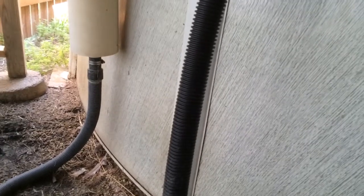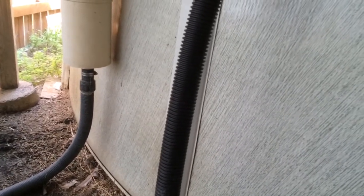For the outflow, same thing — one clamp that can be accessed with just a screwdriver to remove it. Then it's fairly tight. If you grip right here and pull on the black at the same time, you can get it off fairly easily. These hoses last about three to four years. Every once in a while they get a hole in them and you need to replace them. When they get a hole, your pool drains down to that level — takes a couple hours to refill. The hoses we currently have were just replaced last year, so they should still have some life left.